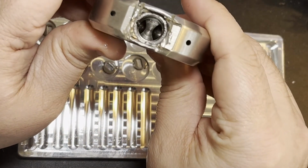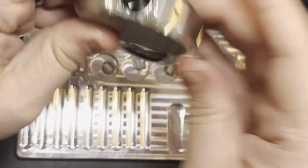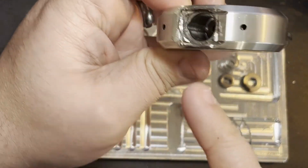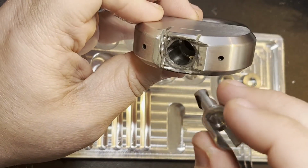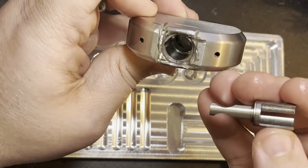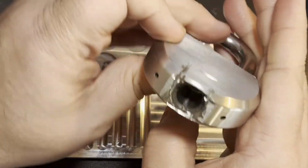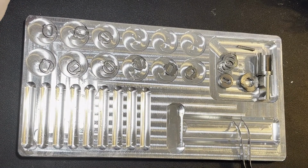You can see the double ball bearings in there. I'm not gonna knock those out, no reason to, but yeah, just a simple mechanism. The actuator here, the groove in the channel here where the sidebar sits, that's what keeps it from turning until the sidebar can drop. Simple design, used basically across the board with all these disc detainer locks. I'd say it's a nice one for being 9 gates. It would be even nicer if it had false sets.